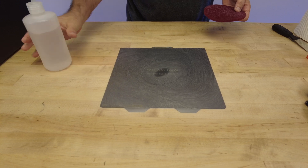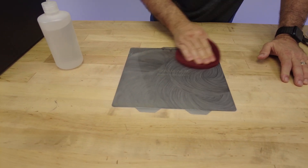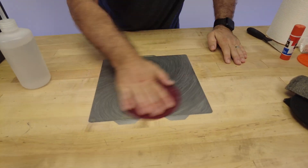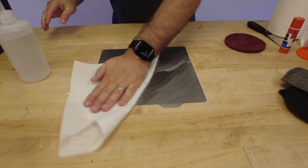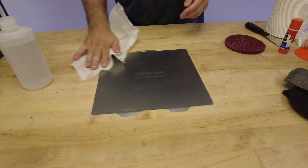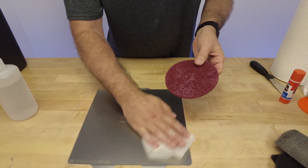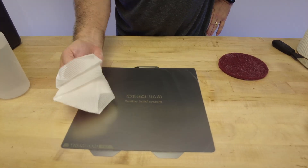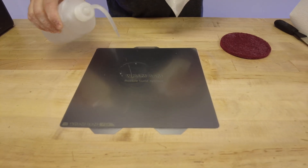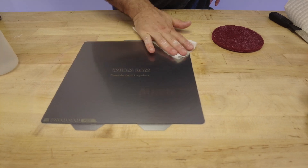You will notice that while I'm doing this, I'm trying to work the center and the corners equally - not trying to overwork only one area. I'm going around the edges and around the corners. So let's have a look - it's only been two minutes. Time is going to be variable depending on your arm strength and how big the build surface is, but this is looking pretty good. You can see on the pad there's already a lot of shavings from the PEX - I'm removing that with paper towel. It's got a real nice satin finish.